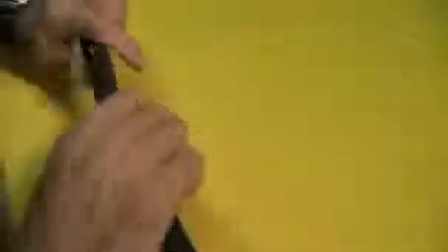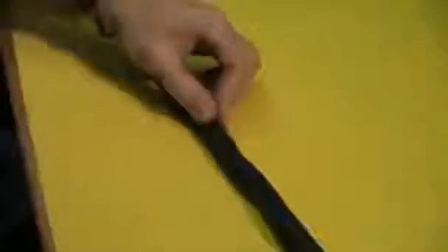When it gets cool enough so that I don't burn myself but still warm to the touch, I'm going to go along with my thumb and rub the overlap edge. This excess adhesive will ball up and you can discard it so that you don't have an exposed sticky spot there. It looks pretty good — it's getting fairly cool. I'll give it a little bit more, but essentially what you do is come along and you can see the adhesive will kind of peel off the tubing while it's hot.